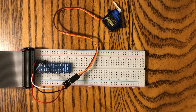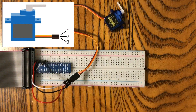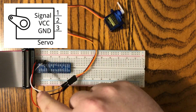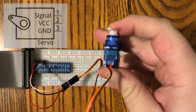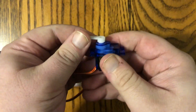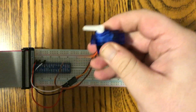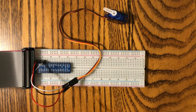All right, so here's our circuit. Like I said, it's very simple. We've got our servo connected to voltage and ground. The third wire — this orange one right here — I've got the white one hooked up to GPIO18. If we take a close look at our servo, on this side you can see the little DC motor that's in there, and then our reduction gear up here at the top. The servo will rotate from one side to the other like that, and we get a lot of control over which way it goes.